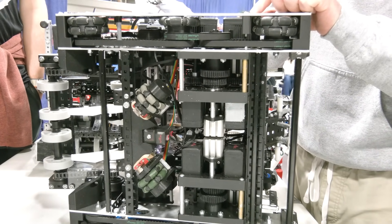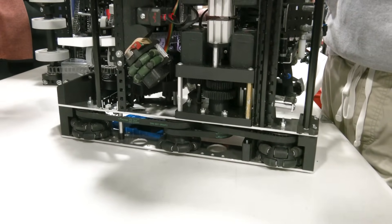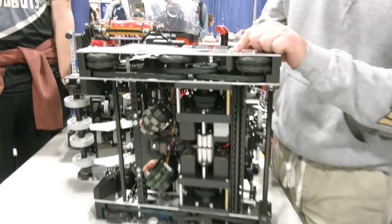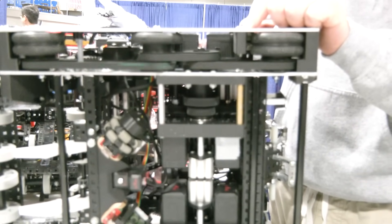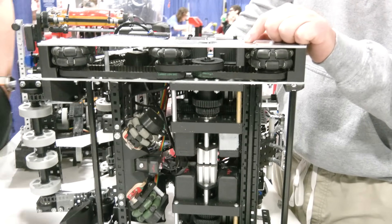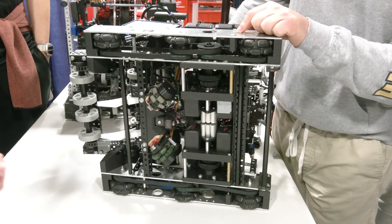We did face a lot of challenges. We studied the design from many other competitions, such as FTC and FRC, while designing this gearbox. The main difficulty is reducing friction while still keeping a very small gear slop. We also need the perfect air pressure for the shifter so it can shift fast enough but not create too much friction on the drive.